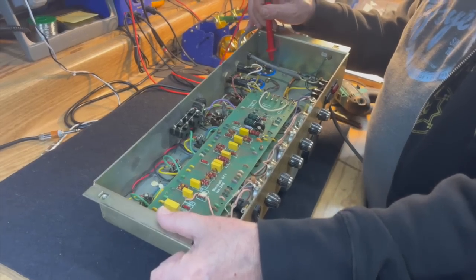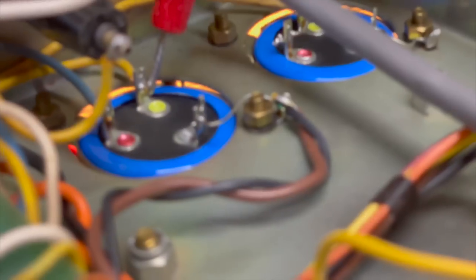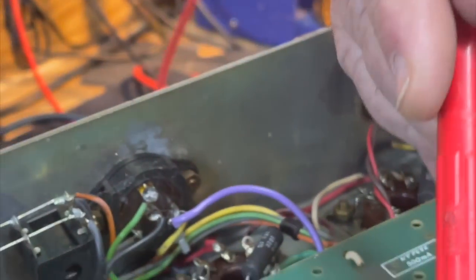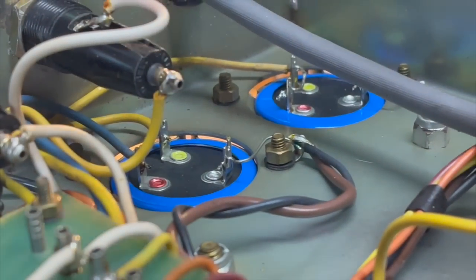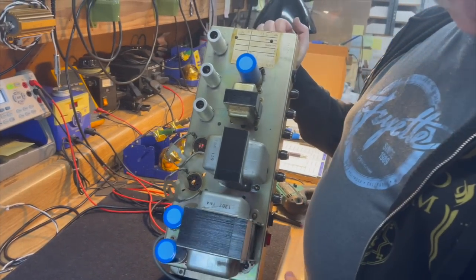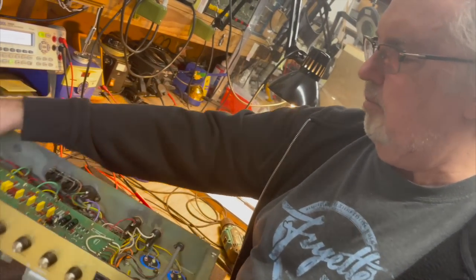and the soldering is super, super clean. That led me to think that it was factory, but it could potentially have been changed, because if you look at the wires in there, they're just stuck into the ends of the capacitors and not wrapped around. And normally, if you look on the pots, you'll see that the wire goes into the lug and wraps around a little bit, but they don't wrap around on here. This one does, but at the end of this wire, it doesn't wrap all the way around the lug. Right. So these look like they were replaced a long time ago. And this one also has the 98, and these are LCRs. And normally you would just order those from Korg. So these were replaced a long time ago, and they're pristine. And I don't think they need to be replaced again.